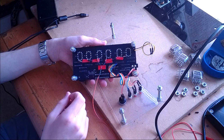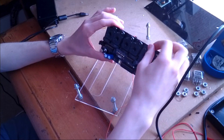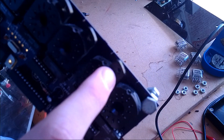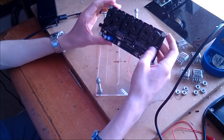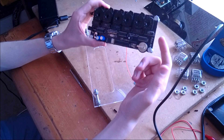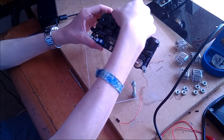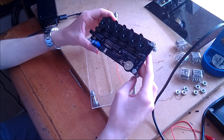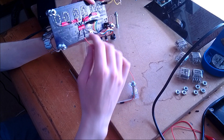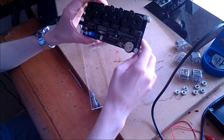I also forgot that these tube holders have little screw-mount tabs on them — great if you want to mount with screws, but I didn't, so I had to hacksaw them all off because the chips need to go there. I socketed the chips because I wasn't sure it would work, and I'm glad I did — a couple of chips blew before I had those protection resistors in and I needed to replace them, so socketing was definitely the right call.